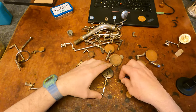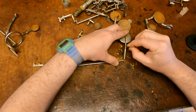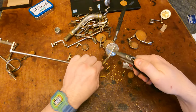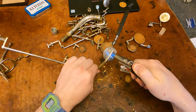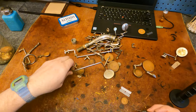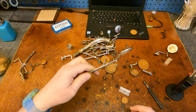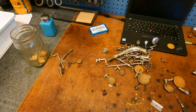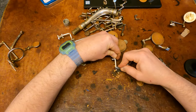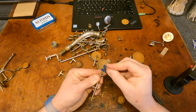Apologize for the chickens — we might hear them talking for a while now. Once one of them gets going, they sort of talk to each other. Bonus is though, we get great fresh eggs. We've got chickens and ducks. Now, if this was a lacquered horn, we'd have to be a little bit more careful with the amount of heat we impart. But since it's plated, we don't really have to worry about that — it would take a lot more heat than I'm likely to use to cause this stuff to bubble. Although sometimes, like on wartime horns, I have seen plating that bubbles really easily. I think there must have been some sort of shortage in proper materials because wartime silver plate on both sides of the Atlantic just seems to be substandard to the stuff that came before and also after.